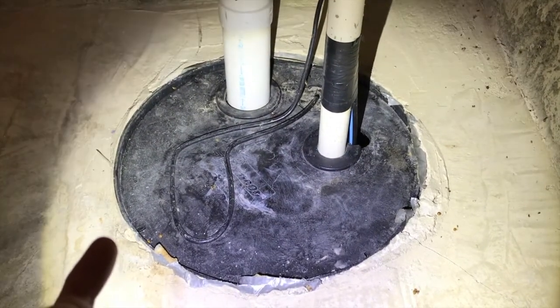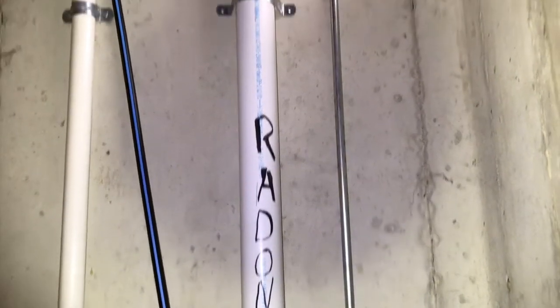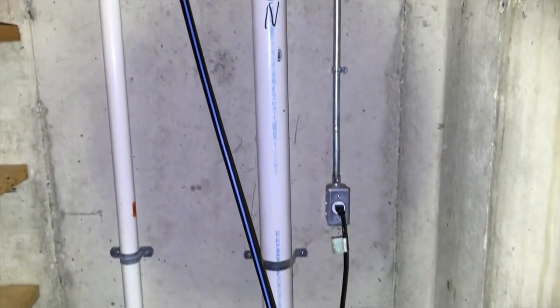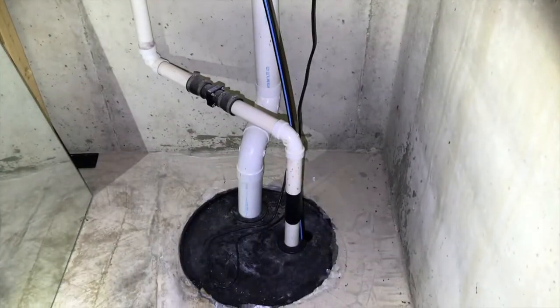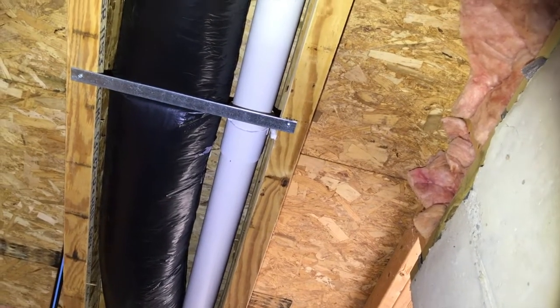With this cap itself, again, solid in color and you cannot see through it. Let's continue along the plumbing and follow the larger pipe — in our case it is labeled radon. Continue all the way up to the ceiling and where it makes a turn at the ceiling. Since we have a passive install, we do not have a pressure gauge installed between the point where it comes out of the ground and the point where it makes its turn at the ceiling. The passive install uses what is referred to as stack effect — basically the outside air pressure working together with the inside air pressure and the pressure down below in your chamber, using those differential pressures to pull the radon gas up out of the ground, throughout your plumbing, and out of your exhaust pipe located at the top of your roof.